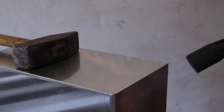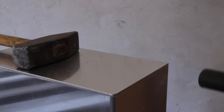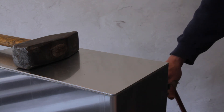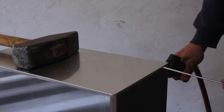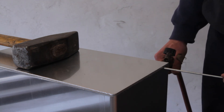To put the sides to the electrical cabinet I tried brazing this with some aluminum braze. It actually takes a lot of heat to heat up this much aluminum, so I ended up using the big torch and the small torch together to make it flow. The disadvantage however is that it doesn't hold that strongly. The first time I tried to fit it in, the electrical cabinet fell out and the sides broke off again. After that I decided to get it welded. I found someone who could TIG weld this, and now it's really strong.